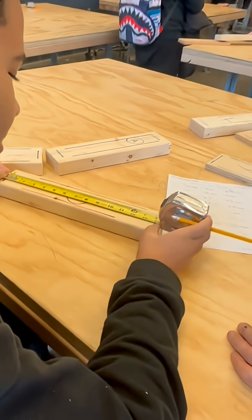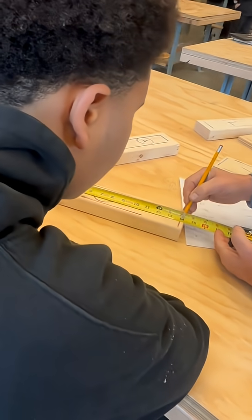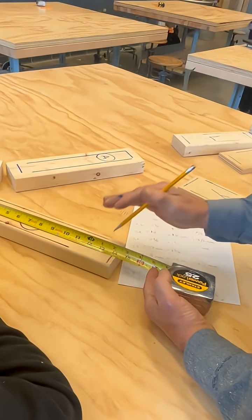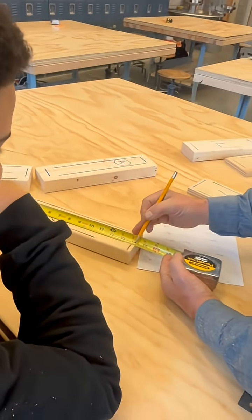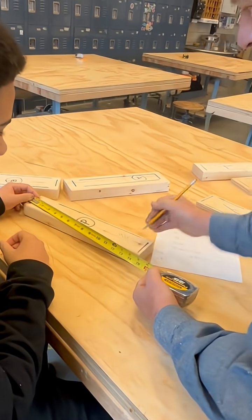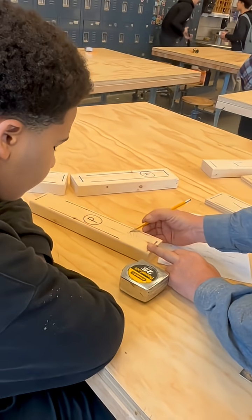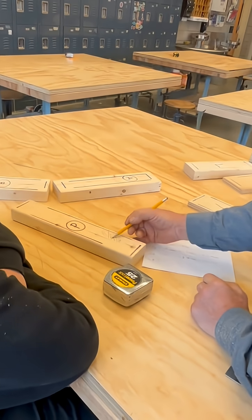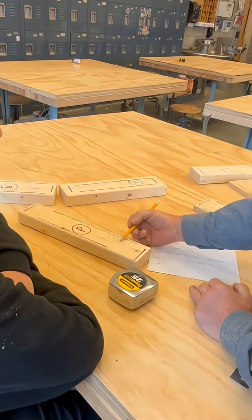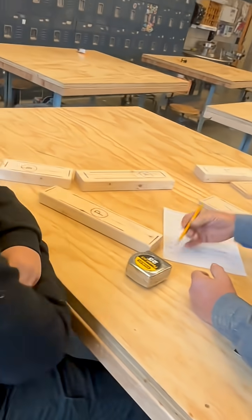You got a question? So how do I identify this right here? So you've got the fractions — you're trying to figure this one out. It's all of 14 inches, then it's one, two, three, four sixteenths. That's the smallest we use in construction. We wouldn't write four sixteenths — technically we're supposed to reduce this. Four sixteenths is exactly the same as one quarter, and that's how people want to hear it on the job site. If you yell out four sixteenths, someone will know what you want, but they're going to want to hear one quarter. It all takes a little practice.